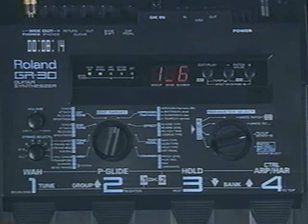also use the S1 and S2 switches on the GK2A. Just like that, you can see the display change. And this will work for any parameter value. Now, the great thing about this particular setting is that it only has to be made once. If you switch the unit off and then on again, you'll find that those settings have been retained.